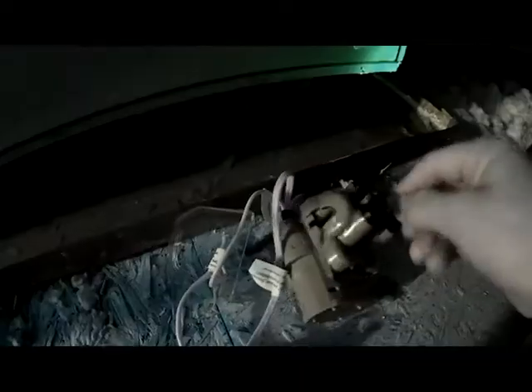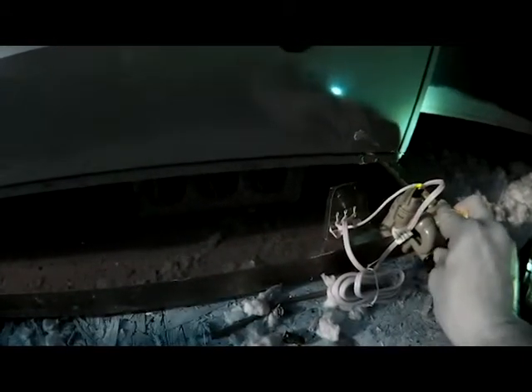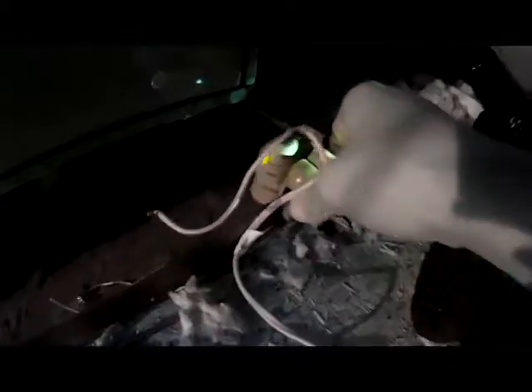I'm going to loosen up my little connections here. What this does is it slides right over the drain pan — sit it down as far into the drain pan as possible — and then we're going to tighten down these screws. Alright, we've got our float switch secure.